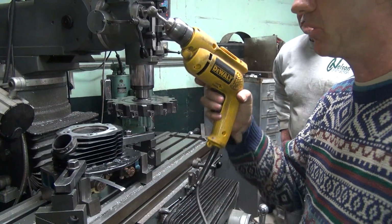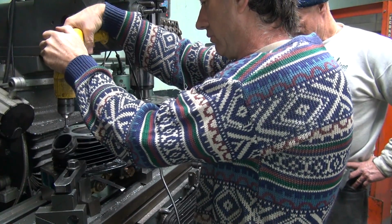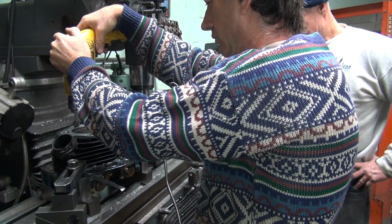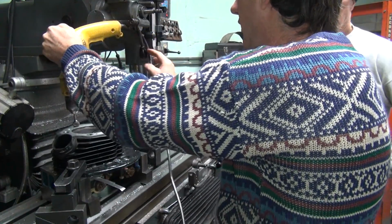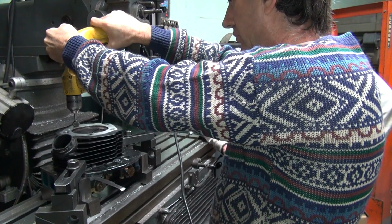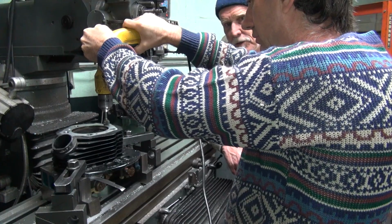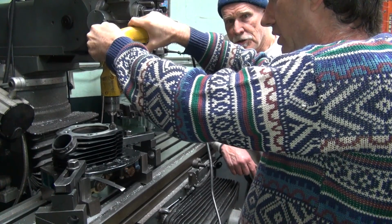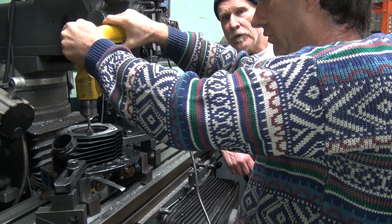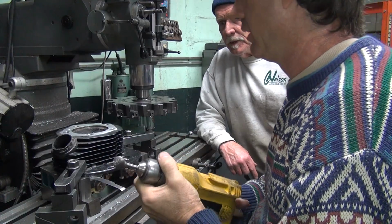Okay, this is called a deburring tool. You ever heard of one of those? That's how that works. You must be very careful with that tool. Just enough, as you notice. See that? Just a few rotations should do it. It chatters though. If you go too fast, it will chatter on you. Like that. And this is carbide. It chips it.